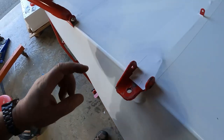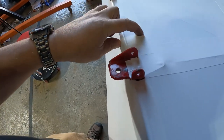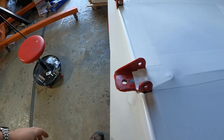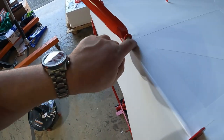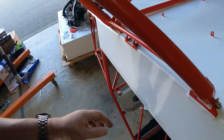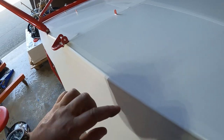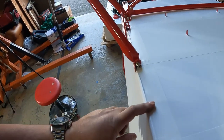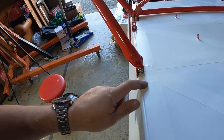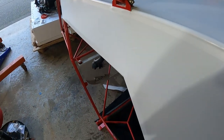So when I was doing the other episode, I was using this 2-inch tape, and I had made some comment about using a piece of 3-inch tape going forward from here. The problem with the 2-inch tape was I cut it very closely around these fittings. With a regular piece of fabric, you're pulling and stretching and you trim off the excess, but the whole point of finish tape is that you don't do that. Well, I had to pull and stretch to get it all to lay down here, and I was looking at it from this perspective and it was actually pretty straight here, but on this side, which is what you'd see all the time, it looked terrible.